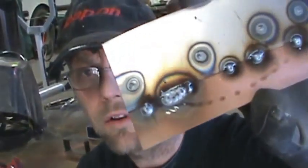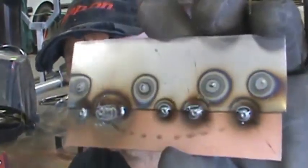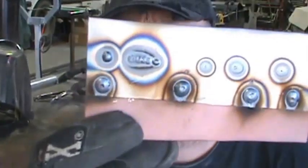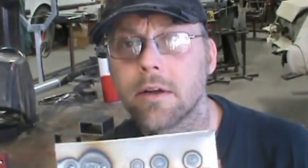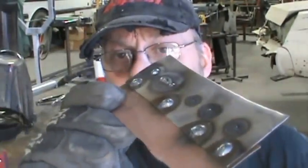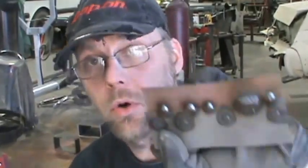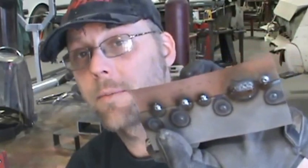Look at the piece — it's pretty clean, not a lot of splatter, not too much to clean up. That is 22-gauge sheet metal with .030 wire. You can see it got a little bit hot — those bumps are raised up, you're distorting the back piece of steel on your fillet weld and you can see it warped just a little bit. Warping 22-gauge sheet metal is very easy. Generally you weld a few inches apart and then go in between those stitches until you close the gap.